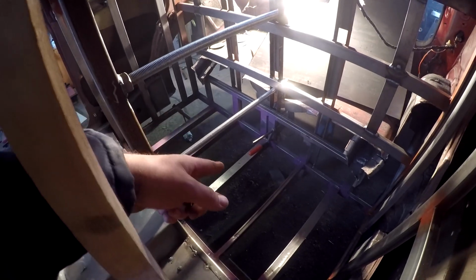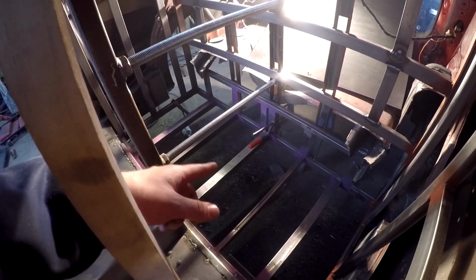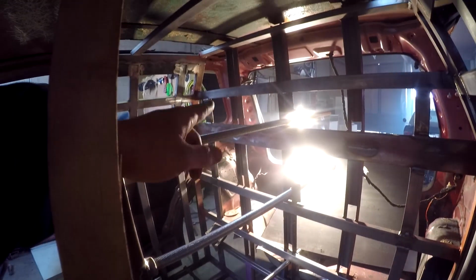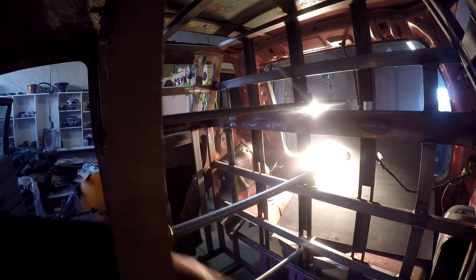They are really good in strength. We plan to put a nut onto the lower beam and weld it onto the steel rod, threaded rod, and then connect it into the floor, so we can get one connection to the floor, and same up in here, and connect it to the roof, so we can have both this side, and then add 2 steel rods from the other side, from there to there and there to there, so we can get it very nicely done there.